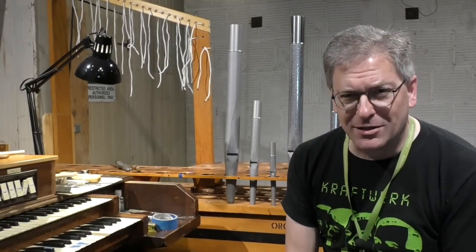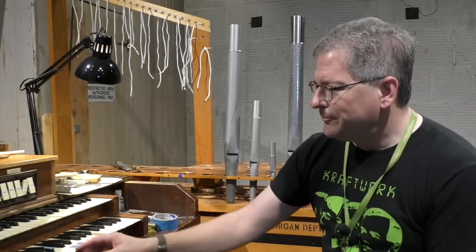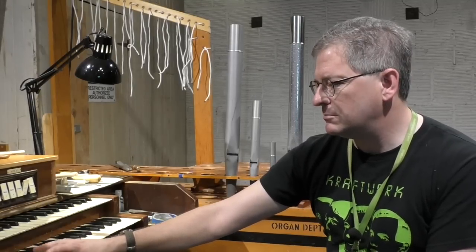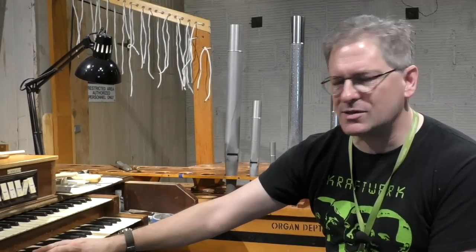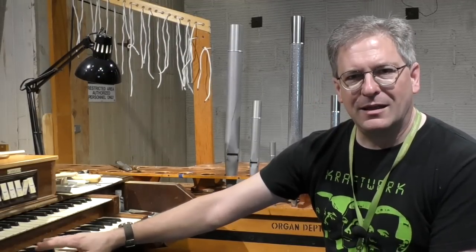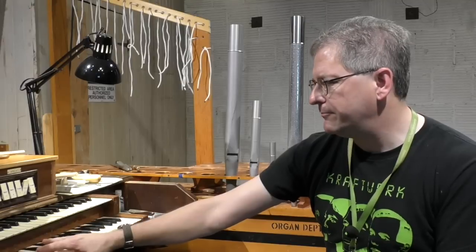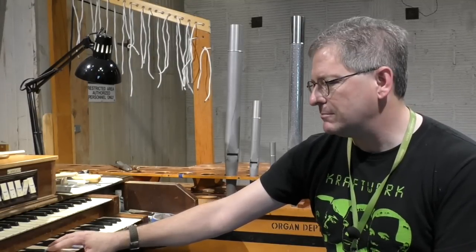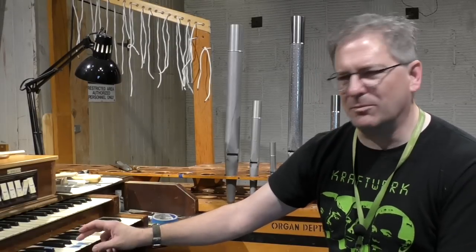And the results are strange, I would say. So the double languid stop has pretty much fallen apart at this point. That's barely speaking its unison pitch. That's alternating between its fundamental and octave, so it's overblowing. And then the single languid ones are doing the same thing. Oops. Completely unusable.